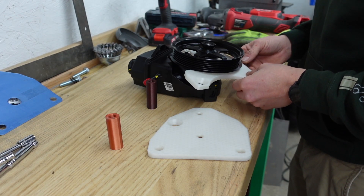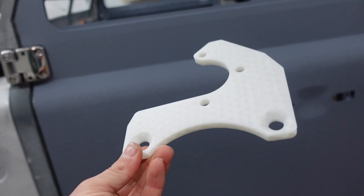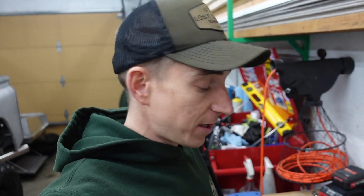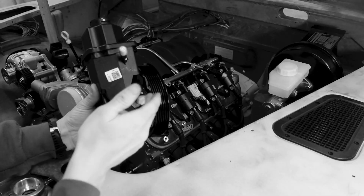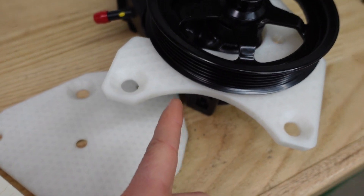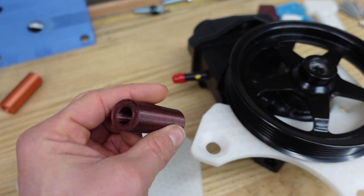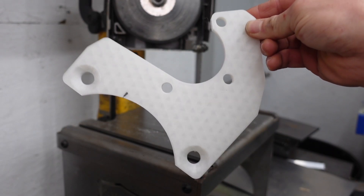Test fitting it — that guy right there is a pretty nice looking piece, but it doesn't work. The top ear runs into a fitting and won't let it sit. All our scribbles and I didn't write down anything about those two lines coming off this side — we need clearance there. We're going to have to modify it, but I put some extra holes in that should still function. We'll only use one of the spacers and bolt it up in that configuration. I guess this is why we're doing it in plastic before we have it made in aluminum.